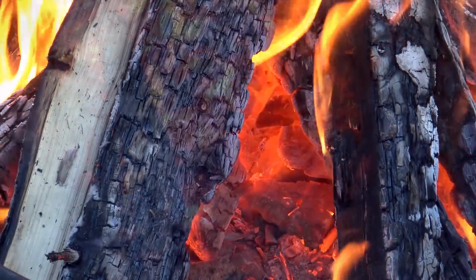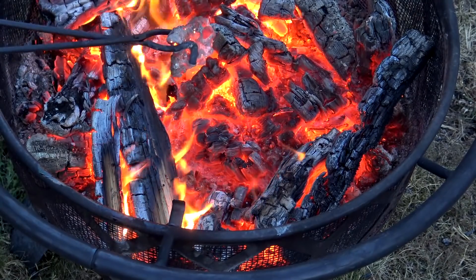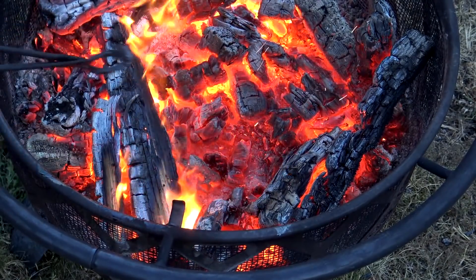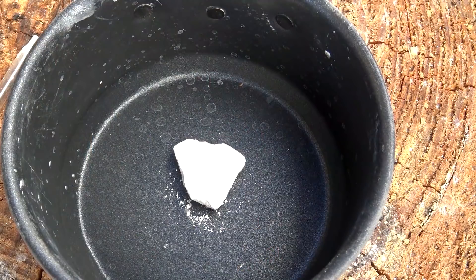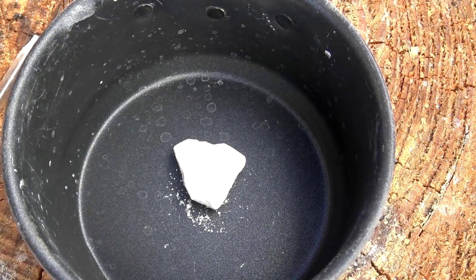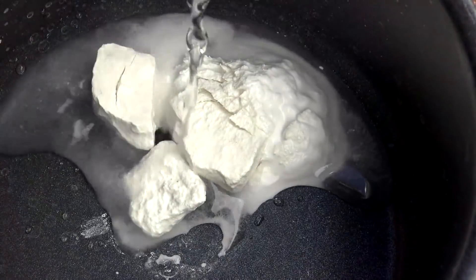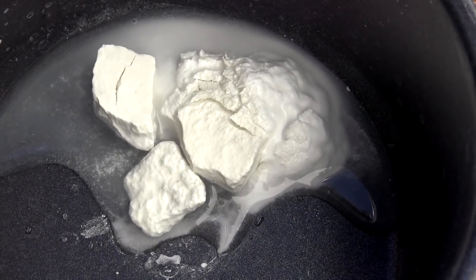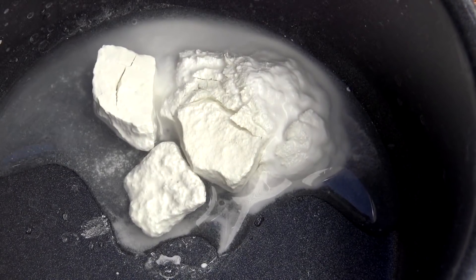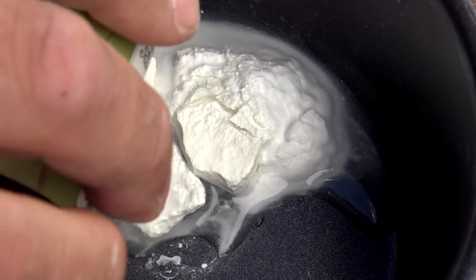There's your stones right there — they're glowing red. We're going to fast forward here about three hours. You can see it's glowing red still. As I mentioned before, the carbon dioxide has been removed. It becomes calcium oxide, which will react with water. Once you add water to it, an exothermic reaction takes place — it generates heat. You can notice the stone breaking down right here. The slaked lime is what it's called when you add water to it. It's quicklime being hydrated, so it becomes calcium hydroxide. And that's what you're going to use as one of your core ingredients for your concrete.